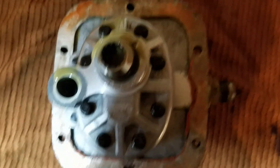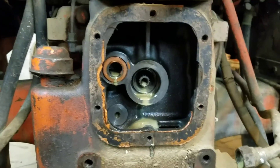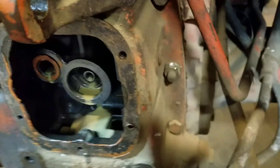We took the pump out — looks good and shiny on the inside, that's good. The inner workings look about the same as the other pump, other than those three bolts that aren't on this one, the double line thing I mentioned, and the coupler is a little different where it sits up against stuff — but pretty sure we can make it work. The bolts around the outside were all nine-sixteenths on the heads. You may have to take a small pry bar once you get all your bolts out to pop the pump off — if the gasket's good it'll be stuck. Pry behind where the line was and it'll thunk and fall away.